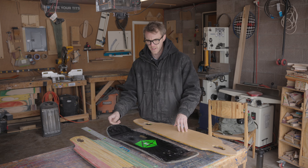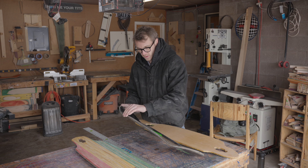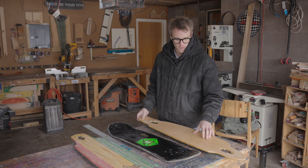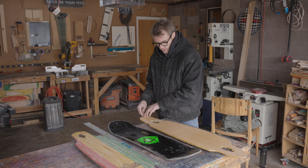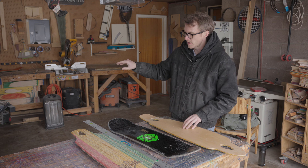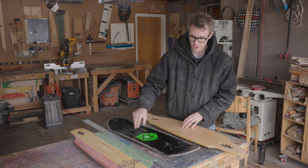Because these different types of skateboards are shaped differently — these have a straight edge and these have a curved edge — I'm going to cut them a little differently. For the long boards I'm going to cut them down the middle and then joint them so I have a straight edge to reference off of my table saw fence. This one I don't need to do that since I already have that straight edge.